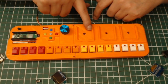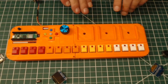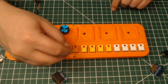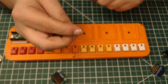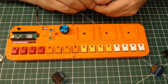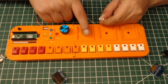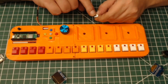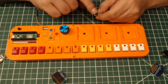Here are tiny little interlocking squares. And you slide in these bays into a magnetic connector. So let's say we have a tiny little magnetic connector positioned right there, and it would be embedded flush as a magnetic interconnect between the bays. So a modular interconnect bay design that would feed power, ground, data, and clock. So it would be just for I2C devices. Sorry, SPI is just too many pins for this.